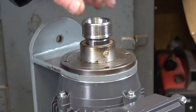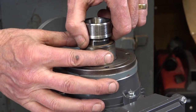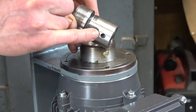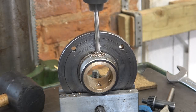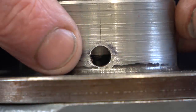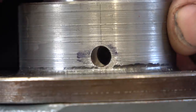With the oiler done, I now need to work out where to drill the hole for the chuck fixing screw. So I've put a piece of black tape on there so I've got the depth. It's going to be the distance between that and that there. Is the screw going to line up with this hole? There's an Allen grub screw in there — you probably can't see it, but it's there. Woohoo!